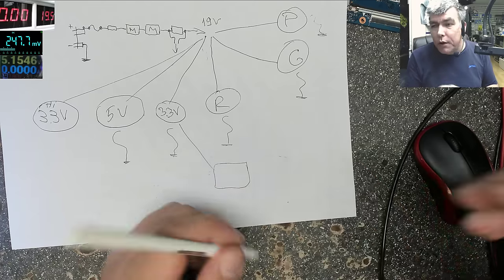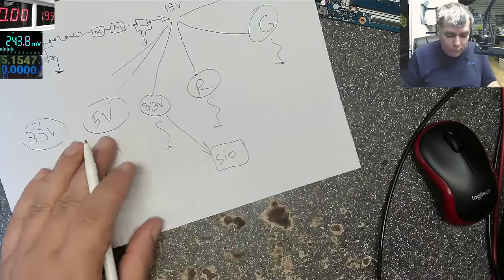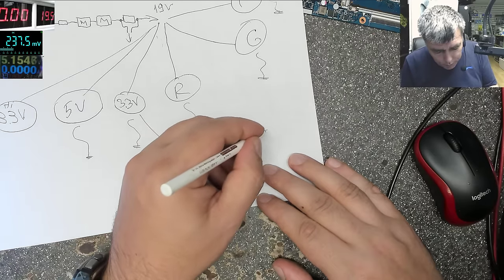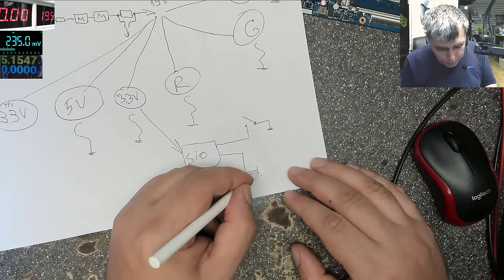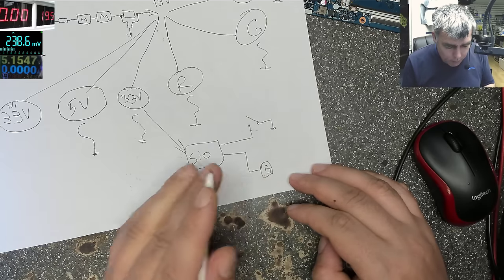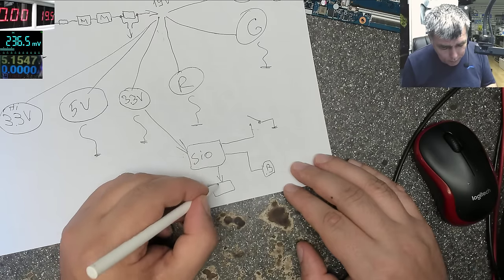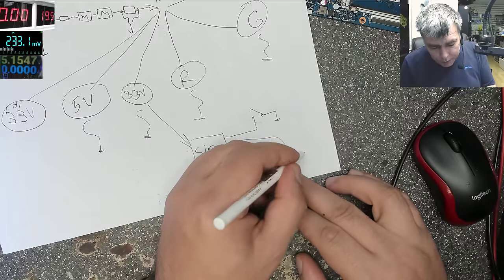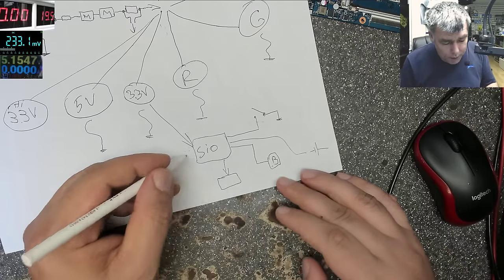So here we have, no, not chips, sorry, the Super IO chip. What the Super IO is doing, it's reading the power button, yeah? It's reading the BIOS chip, also, probably on this one, the BIOS is inside, but that's not important right now. What it's doing, it's reading the keyboard. Yeah, the keyboard is reading a lot of things. It's speaking with the battery on the data lines.